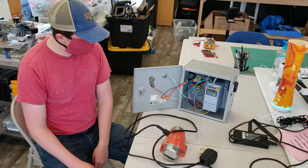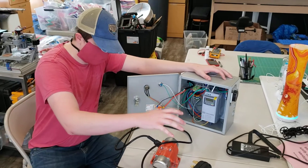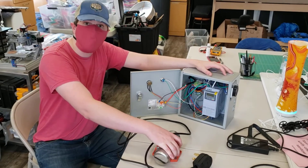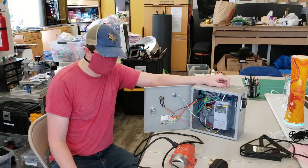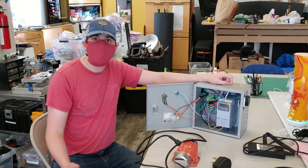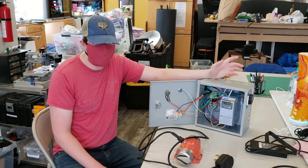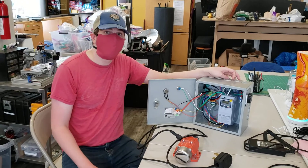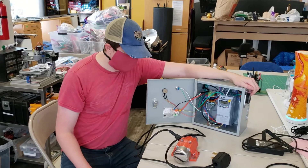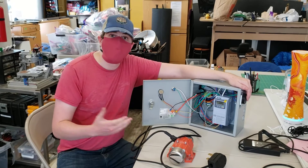Hey, so I'm Rob. This is a variable frequency drive setup that I created for this vibrating motor. It's something you'd use for the compaction of stiff liquids like concrete or soap making or pretty much resin. It also helps get bubbles out of resin without requiring a vacuum chamber — it wouldn't do a perfect job, but a lot better than just waiting for bubbles to come up. It makes fluids act like they have a much lower viscosity, which is pretty cool.